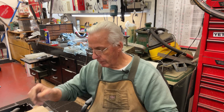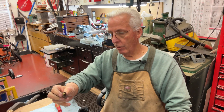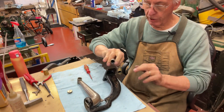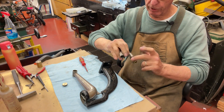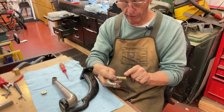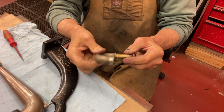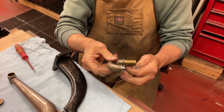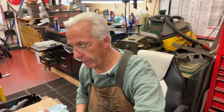Throw the yoke on, tighten it up. Want to make sure that you put a little oil on these threads. And you put just a wee bit of sewing machine oil on the yoke. Because you can see the wear marks here and here — this constantly is doing this. So you want to get a little oil around there and a little oil around there. And that's my tip for the day.